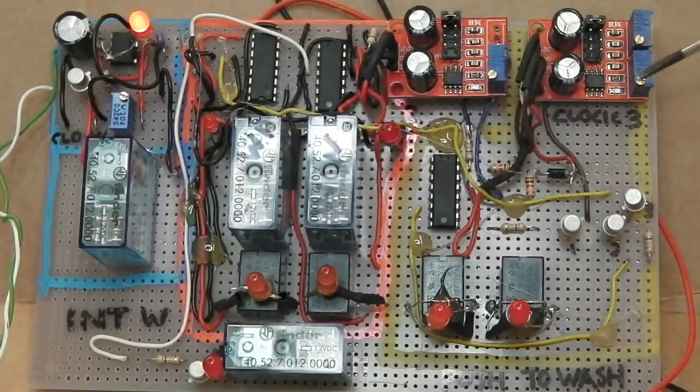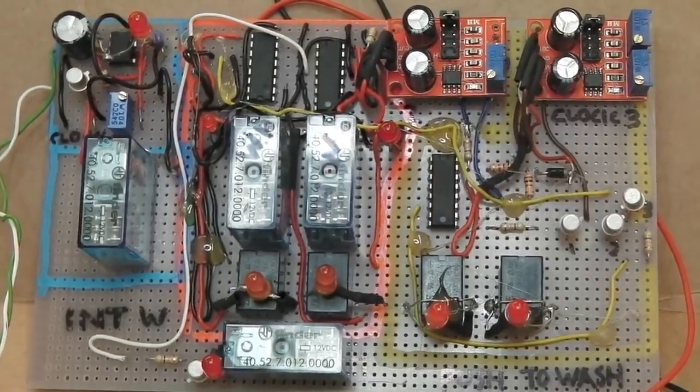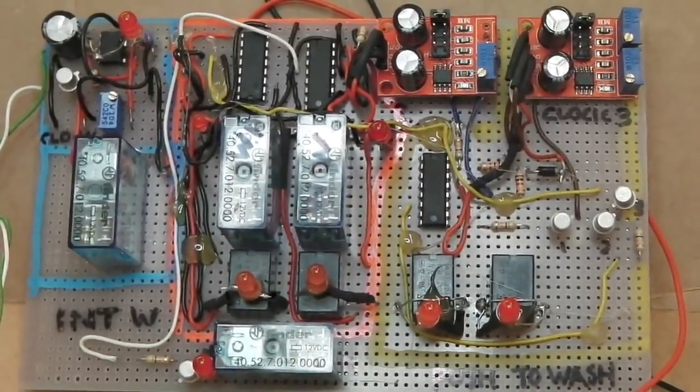These are off the shelf, ready built square wave generators, two of them, 3 quid each, so it's just cheaper buying them than building it on the board, and it takes up less space. All those parts, uber reliable, CMOS system running between 5 and 12 volts, it'll run up to 16 volts. Yes, we'll have a regulator on it, 7812 voltage regulator to run the whole show. Couple of fuses put into it, into a box, out with a wiring loom, Molex plug connectors to make it neat and removable for servicing, and you're off, you're good to go.